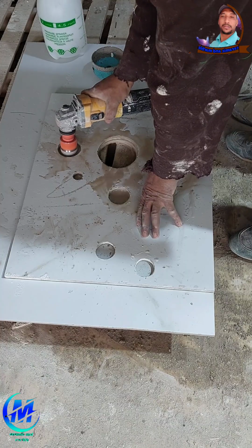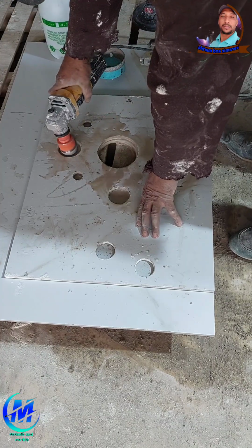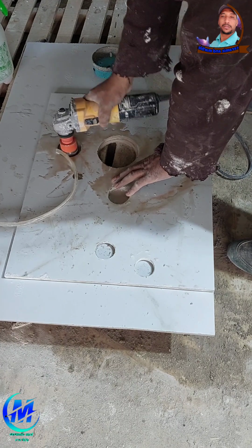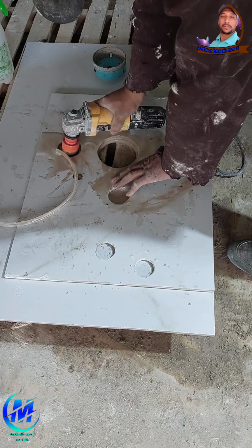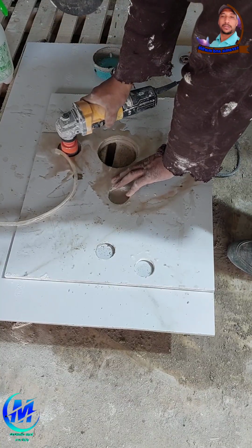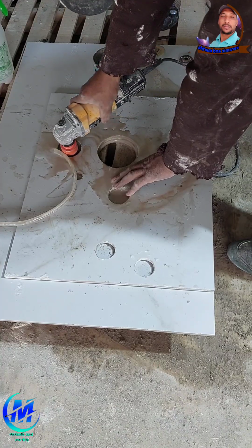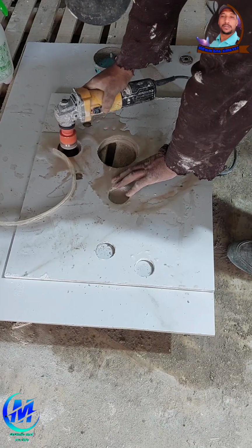Point 2. Cutting tiles like a pro. Cutting isn't just a technical step, it's what separates rough work from clean craftsmanship. Use a wet saw for sharp, clean cuts, especially for strong porcelain tiles. For L-shapes like around toilets or corners, use an angle grinder or specialized cutting tools. Before you cut, mark your tile twice, cut once. Accuracy here saves you frustration later.